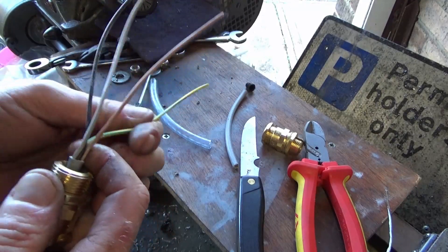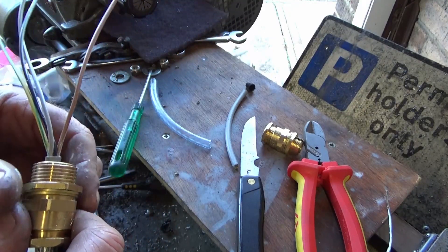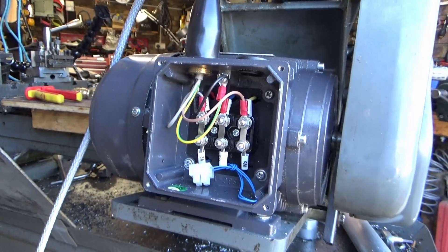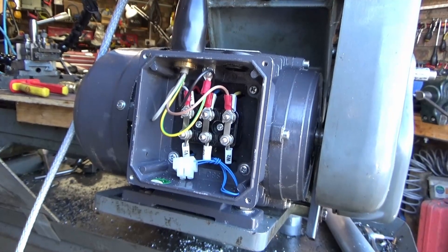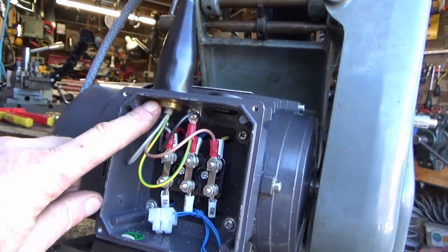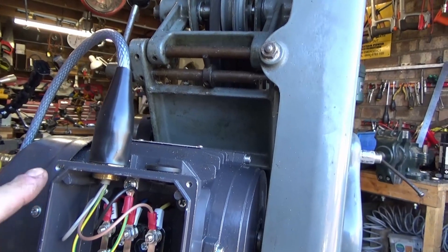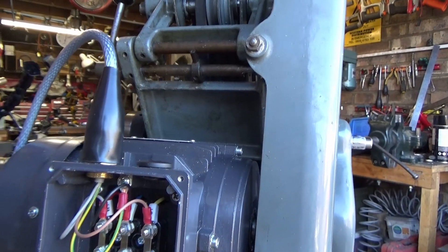As you can see we've got the three phase colours on this one — some SY cable is all black but they are numbered. So we'll get this plugged into the motor. The motor is connected in delta configuration — I'll show you a picture of the back plate which tells you the difference between star and delta. The VFD wants to run on delta. I've used the old sliding fork connectors there with mechanical connection to earth. Because this gland is screwed into the bodywork and framework of the motor I've not bothered with the banjo. The general principle is: if you can screw the gland into the metal you don't need a banjo; if you can't screw it in, put a banjo on for a better mechanical earth connection.